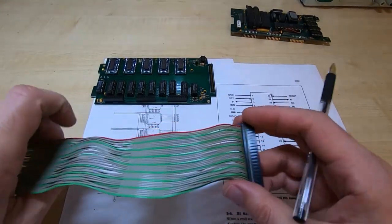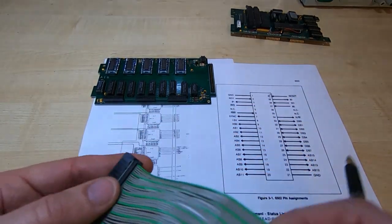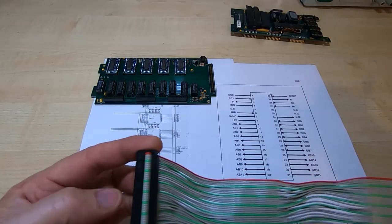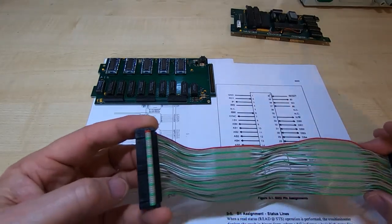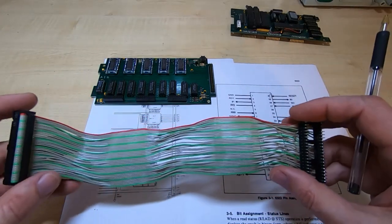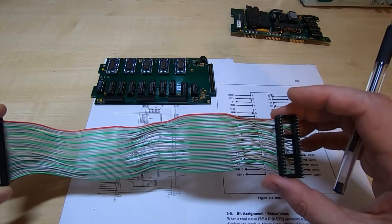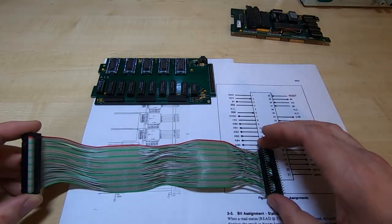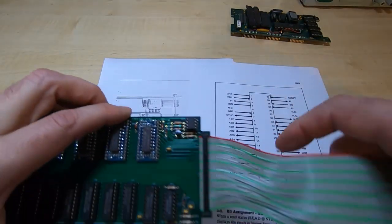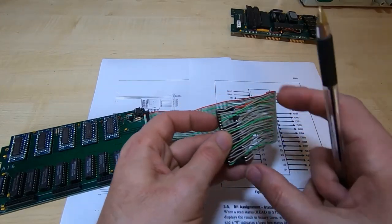Ignore the splits — you don't need those; I just put them in because it makes the whole cable a lot more flexible, but you don't really need them. Essentially the cable will be one of these, with an IDE connector on each end — obviously you need a 40-way version. Cut it to an appropriate length; don't go too long otherwise you might start getting problems. I've gone up to about half this length again and tested it at 8MHz on the Z80 pod and it works fine. Once you've figured out which pin 1 is, we've got pin 1 here and that needs to go to pin 40 on the connector.